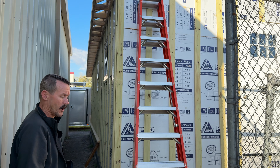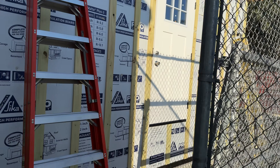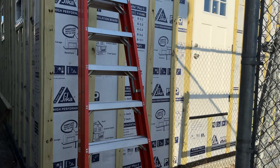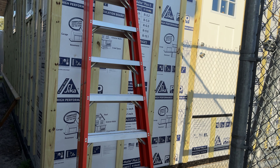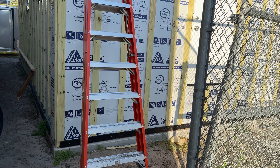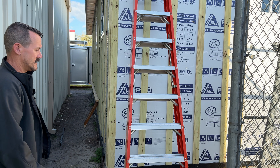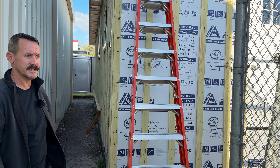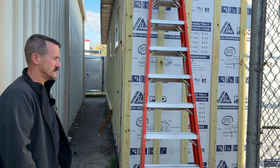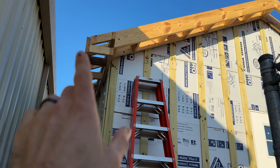The roof, the walls — everything has two inches of poly ISO on it and is totally sealed, so it's a completely sealed envelope. The door is up high because that's the height of the floor — you've got a crawl space underneath. Here in Tampa that's actually pretty common; homes are typically lifted about that high off the ground. It's not a hard crawl but not an easy crawl — you get 18 inches to two feet underneath, and it's sealed up with plastic up the walls.